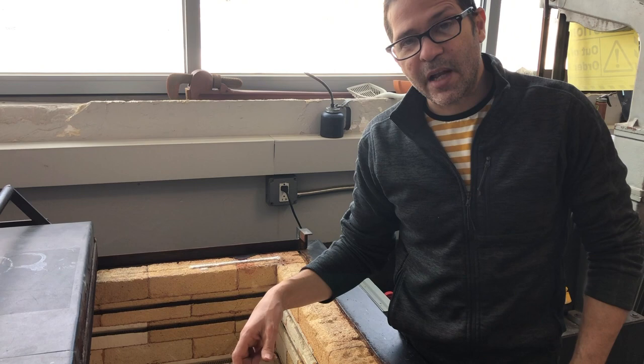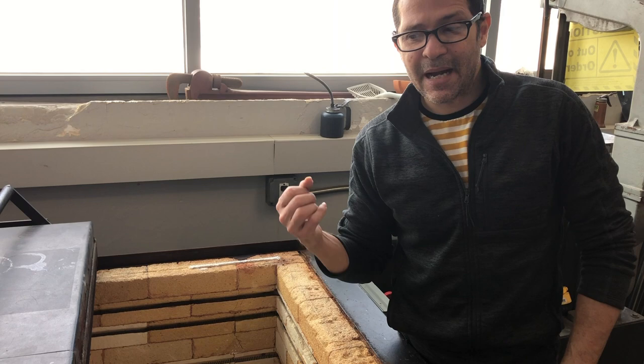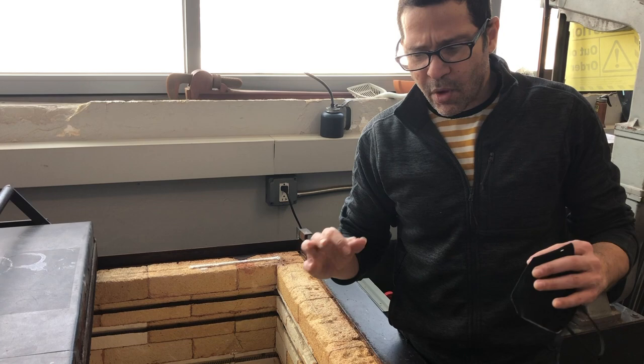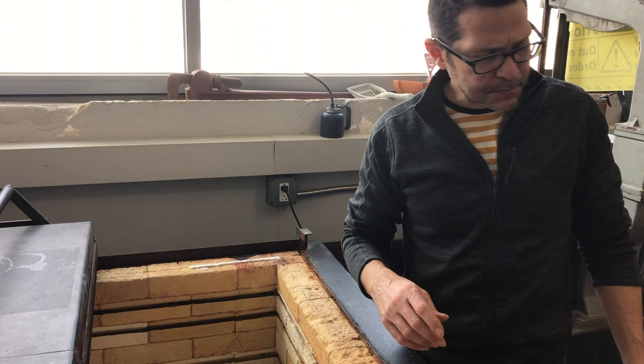The first is safety. Inside this kiln are a ton of elements, and those elements when electrified draw quite a lot of power. The power supply for this kiln is 3-phase 220 — that's a lot of juice, considering it's running on a 50-amp breaker. I want to be absolutely sure that when I open this kiln and reach in, there is no chance that electricity is running to any of these elements.